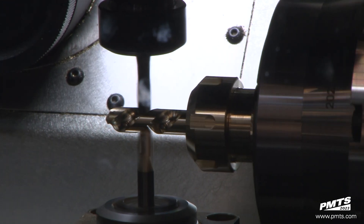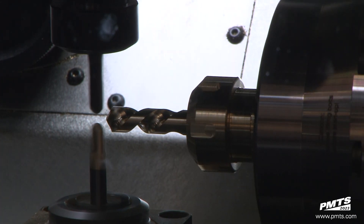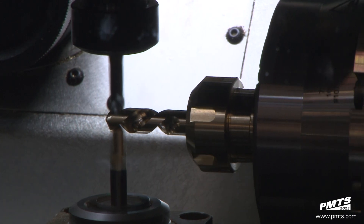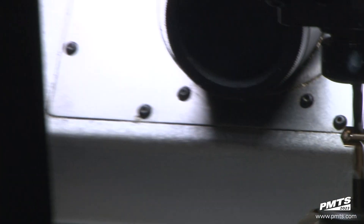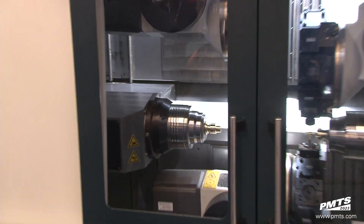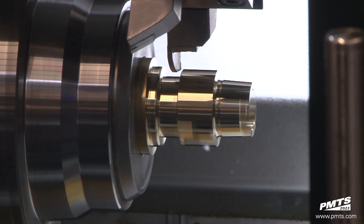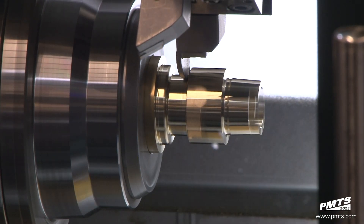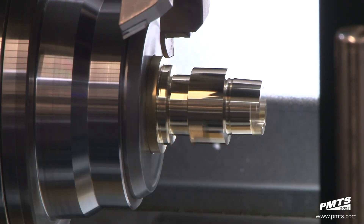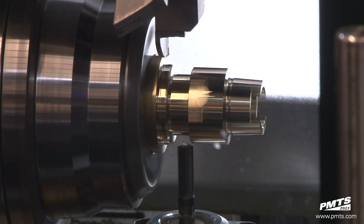Some fear the programming complexity of a single turret versus multi-turret and the timing of the turrets. CAM software today, such as GibbsCAM, Mastercam, and others, have simulation programs that all but eliminate the fear of any collisions. The goal is to program a tool from any given turret to be in the cut on any spindle at any given time and to get to the finish line before the competition.